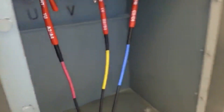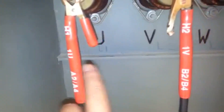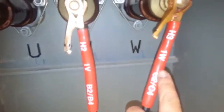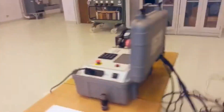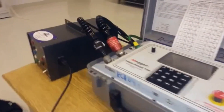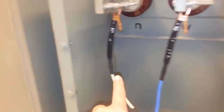The high voltage side is the primary with U, V, W, and the X cable will be connected to the secondary. You have U, V, W with neutral — that's the reason why it is DYN 11.